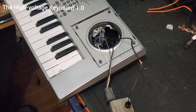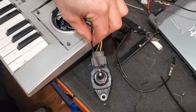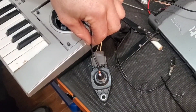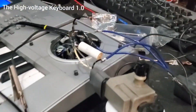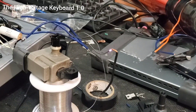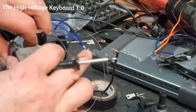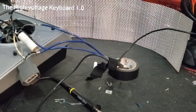Eventually after a few more tries it stopped outputting the way I wanted. I think a high voltage arc went back into the circuitry inside the piano and cooked something, because after a while it just started grunting. I spent two or three nights trying to make this work — I tried different circuit designs, different configurations, different ignition coils, and redesigned the way the arc jumped to ground, but I really couldn't get it to work at all.